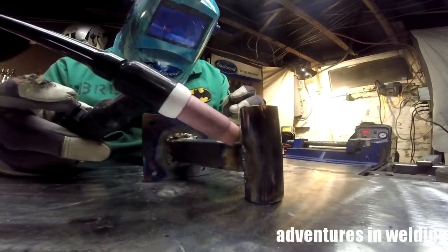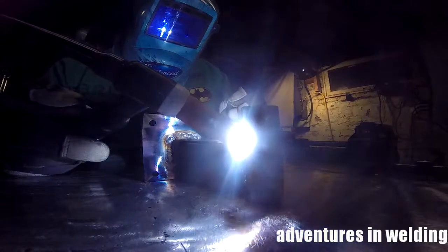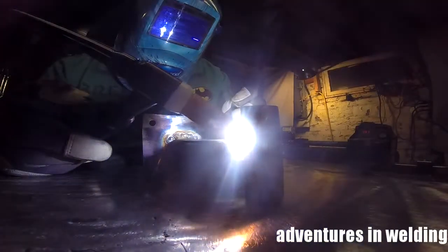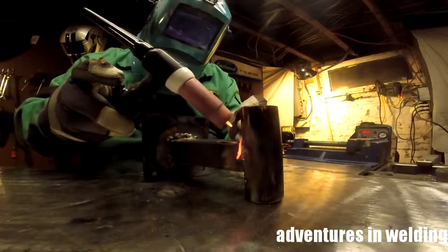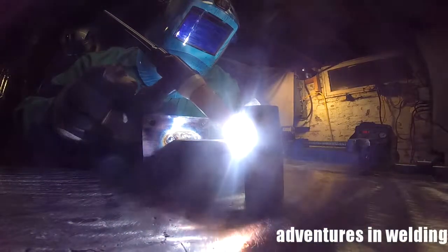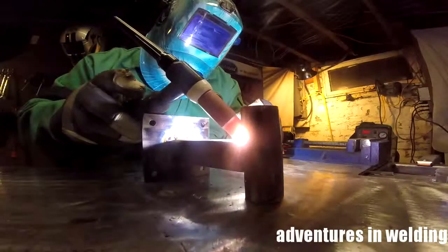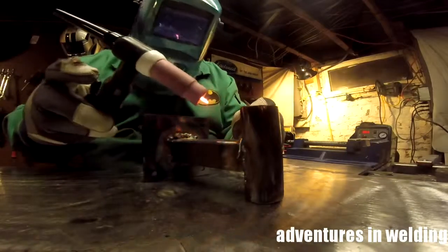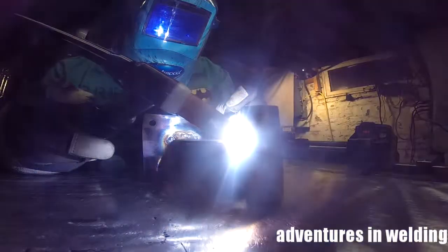Now when I first got started TIG welding, a weld in a joint like this would have really freaked me out. But I just extended the tungsten maybe a quarter inch more, and I know we're going to get good gas coverage in there because having that 90-degree angle there is going to trap some of the gas. So you can have a little bit longer of a stick out in a weld like this, and it's not really much of a problem.